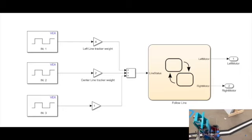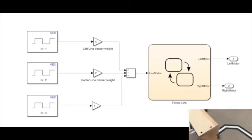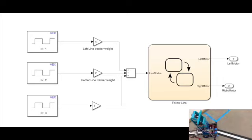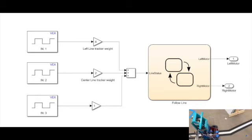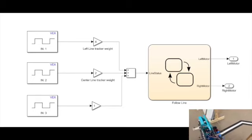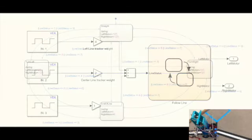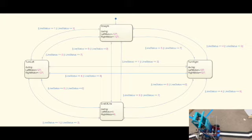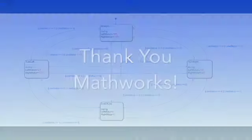When the 8 up button is pressed, it will use a switch to either suppress the values sent by the joysticks to drive the robot manually, or suppress the IR sensor values and autonomous mode. We also slowed down the drive motors while in autonomous so that the sensors have time to make the robot react before getting too far off track. We used digital inputs 1, 2, and 3 on our VEX Cortex for the autonomous function.